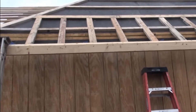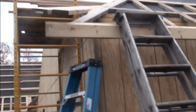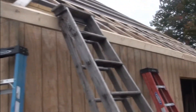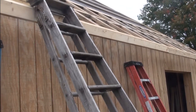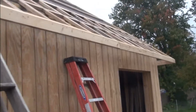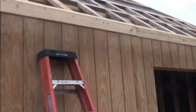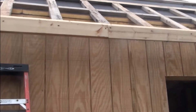When you wrap the house with insulation all the way around to create a thermal envelope without bridges, in typical construction your two-by-fours are placed and then your sheathing is put on the outside, and you put the insulation between the two-by-fours, between the rafters, or between the ceiling joists. All of those studs or rafters are thermal bridges, easily conducting the cooler or hotter temperature from the outside to the interior compartment.